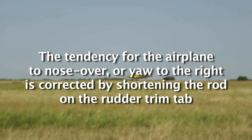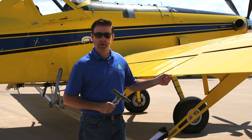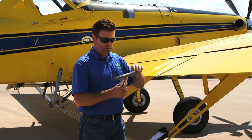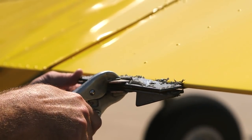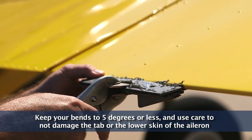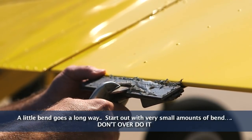Based on my flight evaluation, this airplane has a slight heavy left wing. We're going to make adjustments to the right-hand bendable aileron trim tab to correct for this left-wing-heavy condition. To bend this tab, I'm going to use a custom tab bender that I've made. You can also buy a tool called a hand seamer at any local hardware store. When you bend the bendable trim tab, it's important to keep your bend to something less than five degrees — more than that and the tab becomes ineffective.